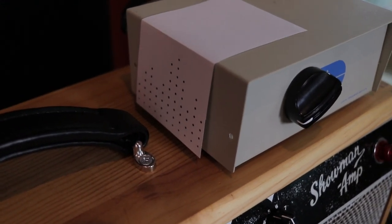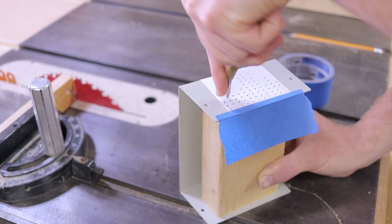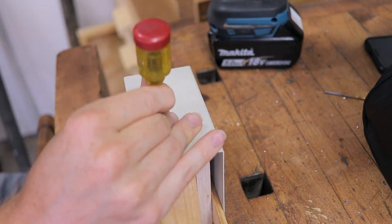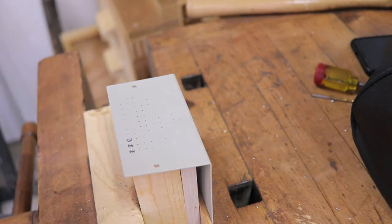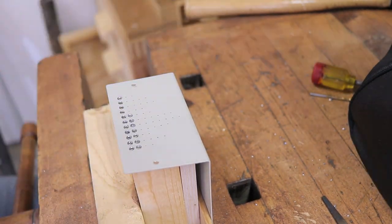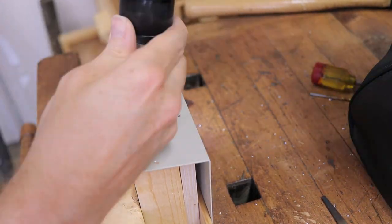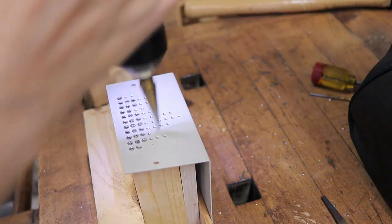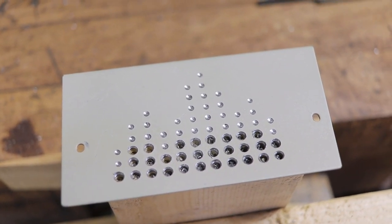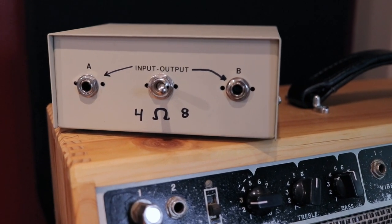I printed out a little template — a pattern of dots resembling a spectrum analyzer and kind of my little logo. I took it to the garage, used an auto punch to mark the holes, then an awl and hammer to make the marks deeper, and then used a step bit in my drill to drill a whole bunch of holes. This part was the worst part of the project — it took longer than actually building the whole thing. I actually liked the look of the partially drilled holes, so I left the top rows only partially drilled for a sort of two-tone effect. I'll keep an eye on the heat and can always drill more holes if needed.